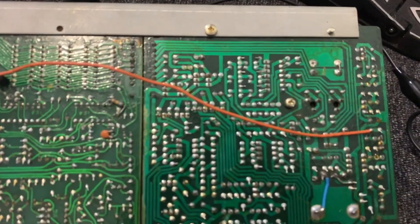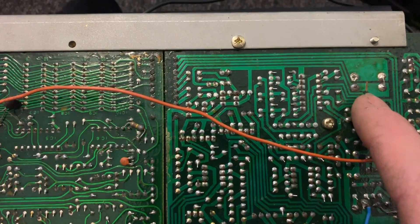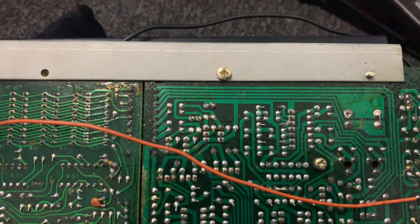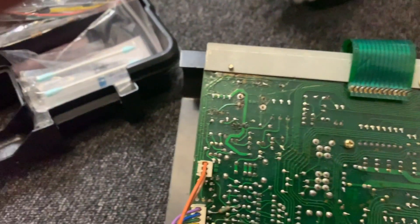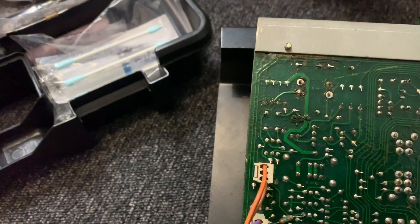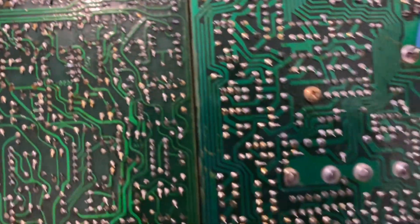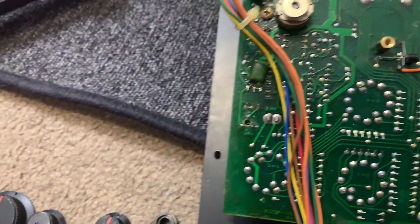Flipping it over to the other side, a few things I've noticed. The switch has been replaced before — that's the tap switch. It's a really common thing; switches fail on these. They had to cut the track and solder the new switch in. Over on this side, the start-stop switch has also been repaired before, which is quite common. There's also been some other modifications and tweaks to the circuit, probably to bypass broken tracks. It's definitely been worked on before.